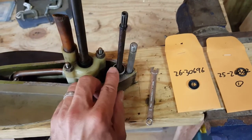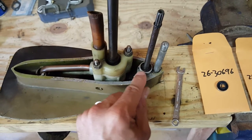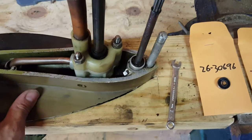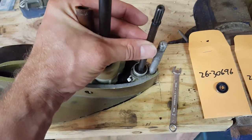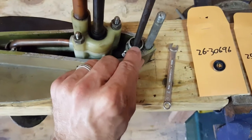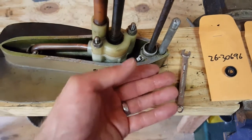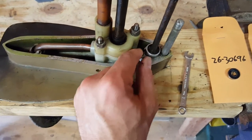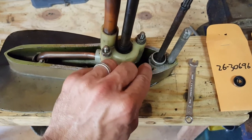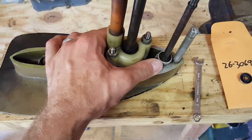I have just determined that I have a faulty seal in the shift shaft area of the lower unit. The shift rod turns and the turning is controlled by the power head — the handle on the power head for shifting from forward to neutral to reverse and back. This rod goes through a seal that contains the gear case oil inside of the gear case unit, not allowing water in or oil out. This seal has failed. I just did a pressure test and that corroborates a finding that the customer had when he pulled it out of storage — there was no oil in the gear case unit, and I'm sure it leaked out over time while it was being used.